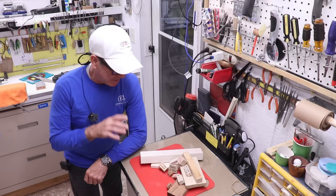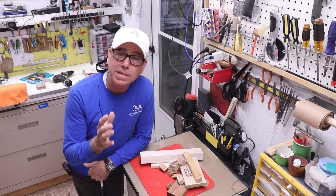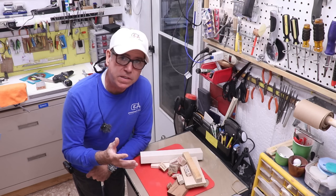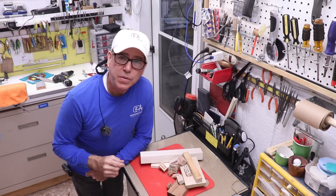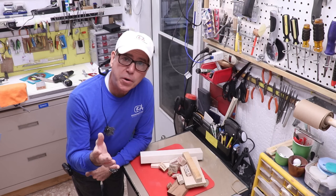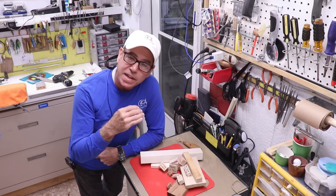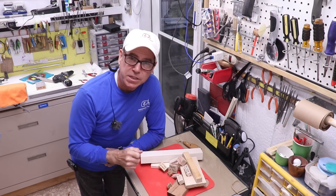The question is: what kind of wood do I use for any particular lure? A lot of times the question is phrased like, 'what's the very best wood for making lures?' — and that's really an impossible question to answer. It depends a lot on how you're making it, what's important to you, and what aspects of the build you're focusing on. For instance, if you're heavy into carving and want really precise clean carves, it's going to be important that the wood carves nicely regardless of its density. Density is really the key factor — unless you're looking at the beauty of grain because you're going to leave it a sort of nude lure. Here's what I made out of teak — even the bib is teak. Typically a good carving wood will be something on the denser side; a wood from a slow-growing tree with a very tight grain usually will be a lot more buttery when you carve it.